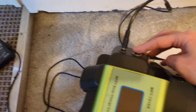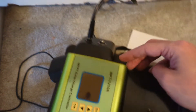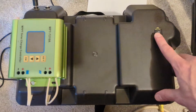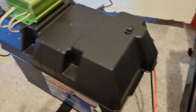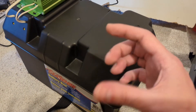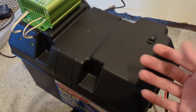They're 8-amp diodes on each side so they can't interfere with each other. If I plug in two power adapters, they won't back-feed into each other, and I can charge at a higher amperage. The whole thing is set up on a power switch with a wire going out to my e-bike on a 40 or 60-amp breaker — those common white little breakers you find in scooters or e-bikes.